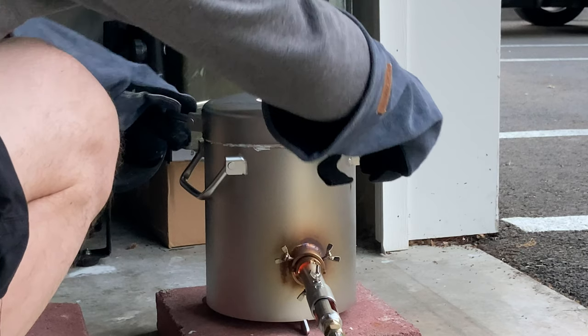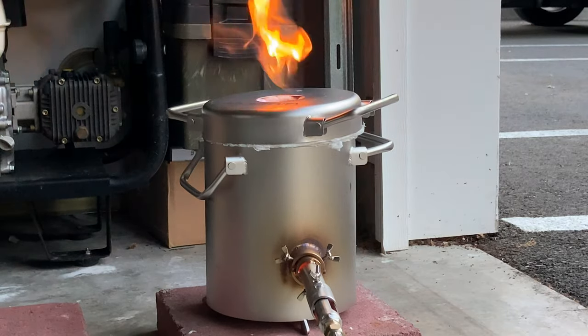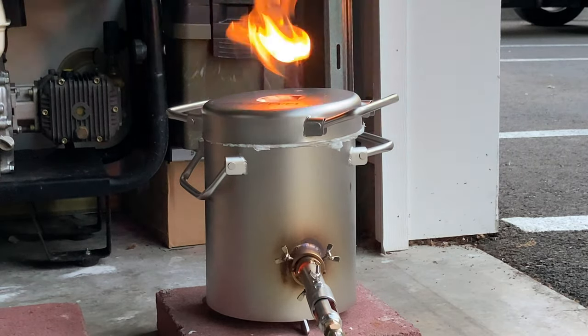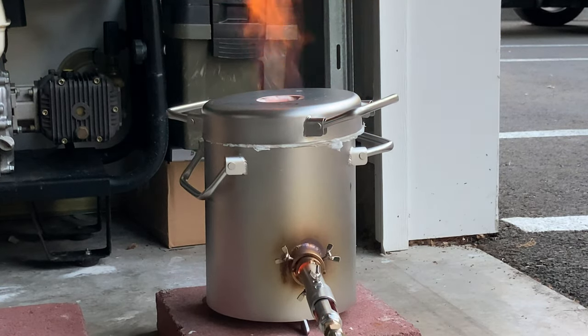A carbon filtering mask is the trick to not breathing this gunk. Make sure to wear heat resistant gloves like you see me doing. As combustion continues, the flame exiting the vent hole at the top of the forge will transition from an incandescent soot yellow and orange color to a more optically clear blue color. That indicates more complete, hotter combustion — exactly the thousand degrees centigrade temperature range we need to get the catalytic converter to work, and in an upcoming video you'll see that.